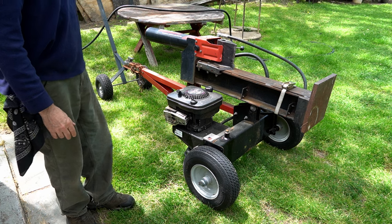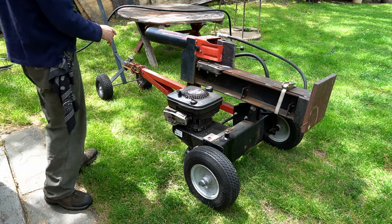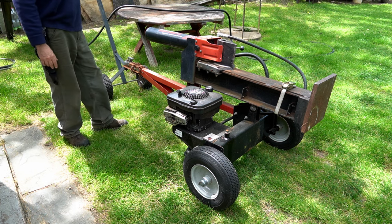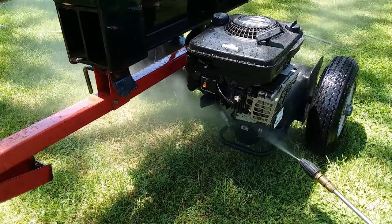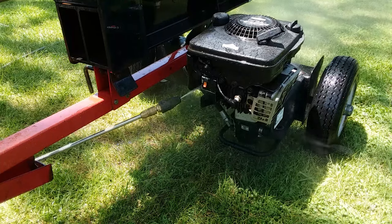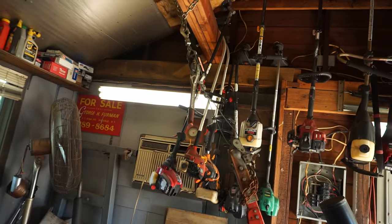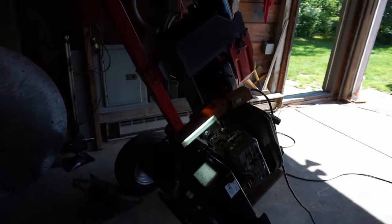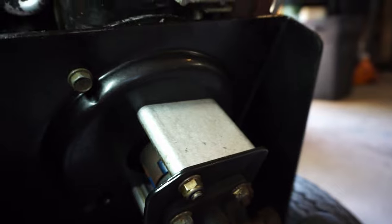We've got a couple of options. I want to turn the whole thing upright - it's on a pivot. Once you get it up to a certain height it teeters over. It's nicely tied up so it can't fall over, we got some chocks on it. There's a Lovejoy connector in here - it's a nice rubber one with rubber pads on it, so it should just come apart.